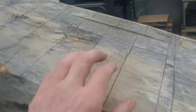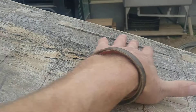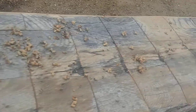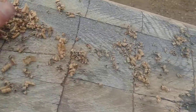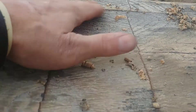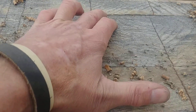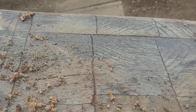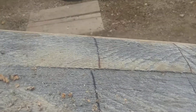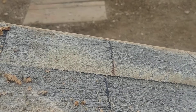I'm going to show you — I'm planing off this side. You can see there are a couple of little chunks where they cut it, and I'm taking those off with the scrub plane — the one I sharpened in the last video. I don't know if you can tell how big that hump is, but it's up at least maybe three sixteenths. It's dirty too. I'm going to plane that off.